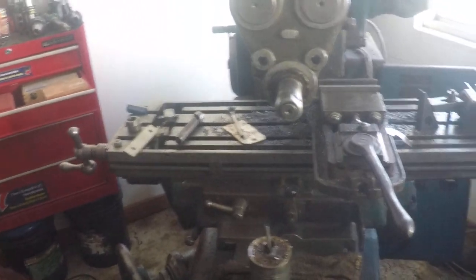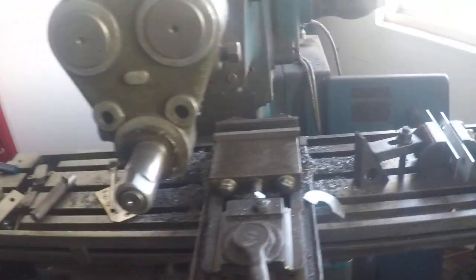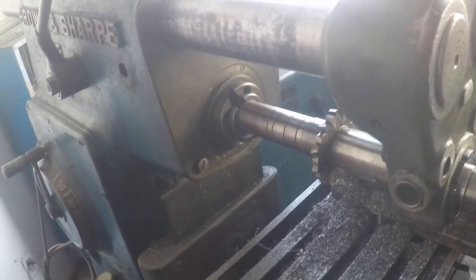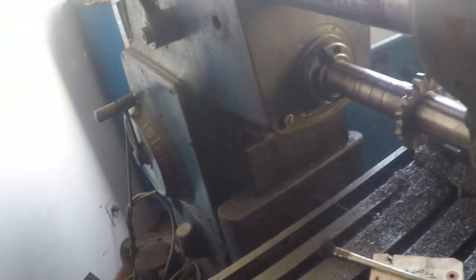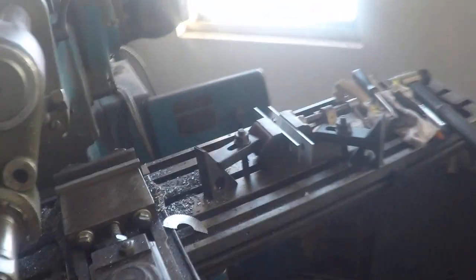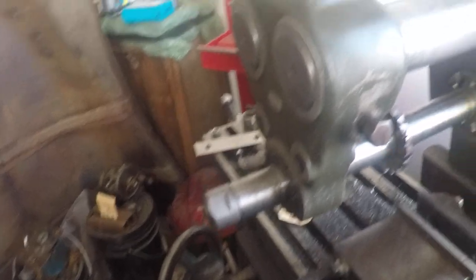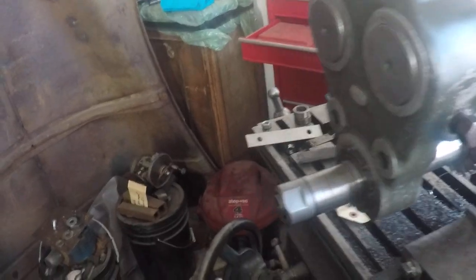Then we've been working on the mill — or with the mill — the last few days. It's a Brown and Sharpe Number Two Plain Light Mill. It's probably about a little bit smaller maybe than a Kearney and Trecker Number Two. It works pretty good. It's got a universal head that I've got to rebuild because it's got all the old grease in there. We've got two overarms and two supports here, but the oilers don't work in either one, so I just oil the bushing before I put it on and away we go.